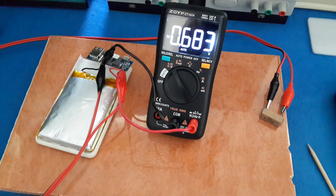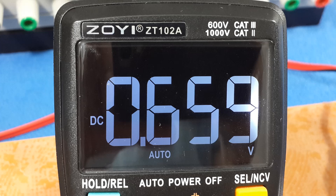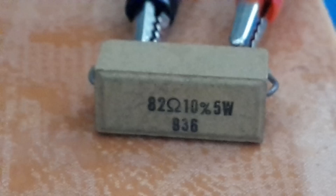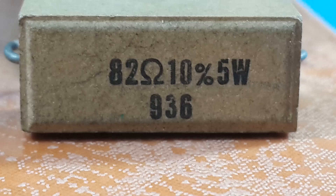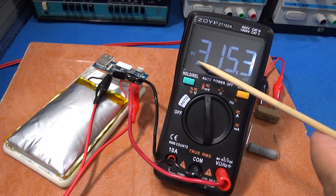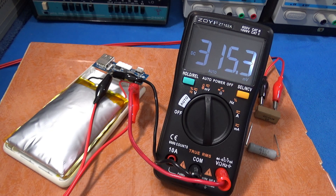It's already the next morning and the voltage has dropped under 0.7 volts. For me it's time to switch to a lower ohm resistor. Remember, because it's a damaged battery I cannot fully trust it, and I need to drain the remaining current in the minimum amounts possible. The voltage is getting lower and lower, and soon the battery is not going to be a danger for anybody.